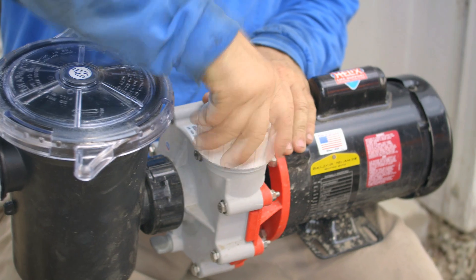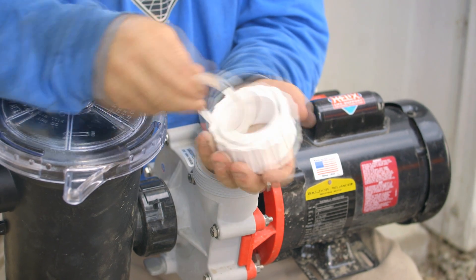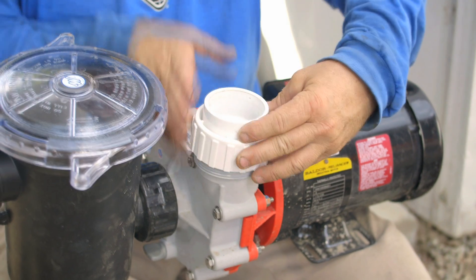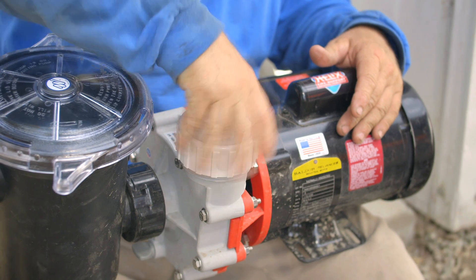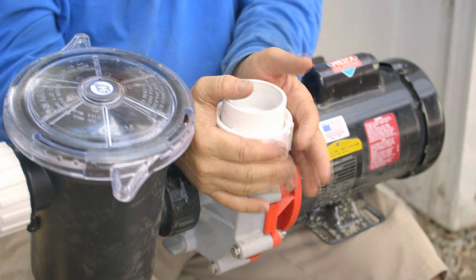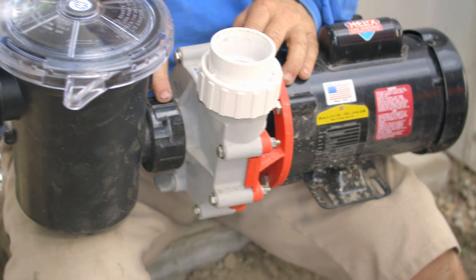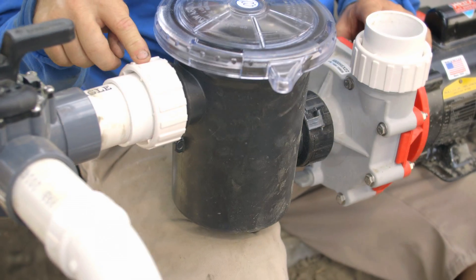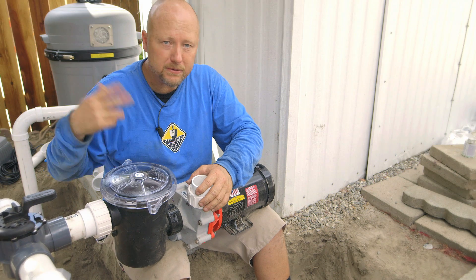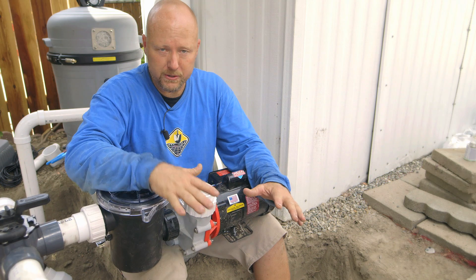There are a couple of seals you're going to want to know about. It comes with these pump unions, and it just comes with a simple gasket right there. You don't need to put any thread sealant on here because this gasket is going to keep it sealed. We usually hand-tighten this, and I might give it a snug turn with a wrench — barely a turn — and that's going to keep it from leaking. There are also unions here to check. If you leak air from these two spots, the pump will be running but you're not going to be producing any water flow.